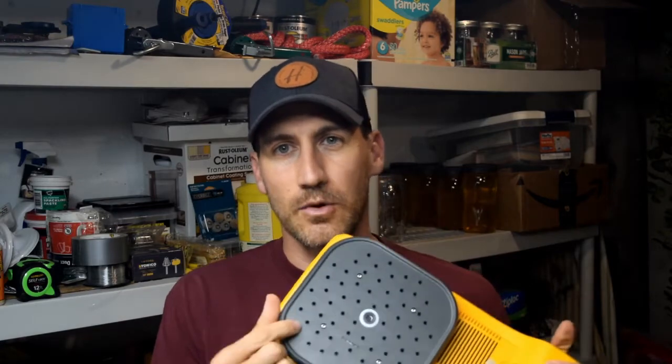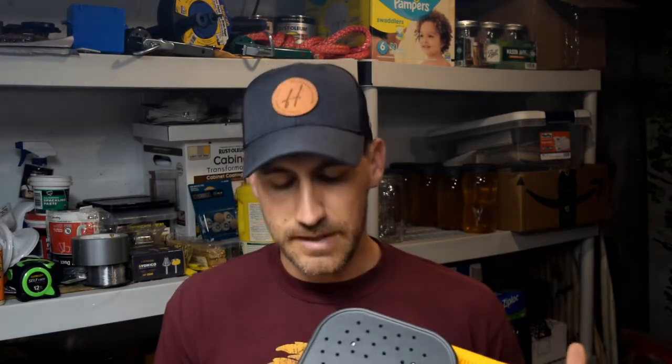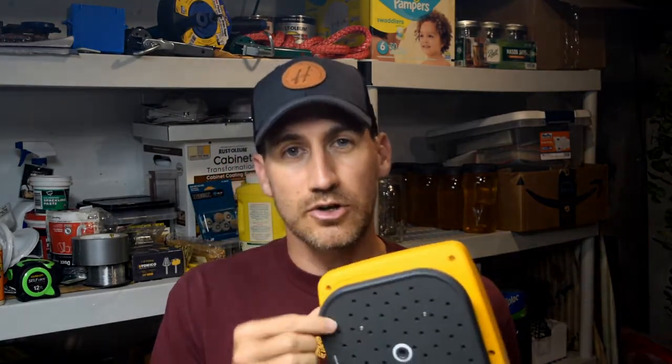I900, I910 — a review for those of you that might not be familiar with this. This is essentially an ultrasonic tool. It's got ultrasonic microphones in here and it's all about detecting air leaks, partial discharge or corona on high voltage applications, or arcing for electricity. Traditional ultrasound has a single microphone. You've got a set of headphones. You tune the ultrasonic tool to a very specific frequency that you want to be listening for.